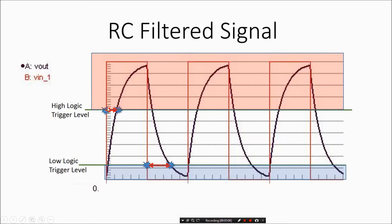The RC filter isn't good for D-shot because it shifts the logic zones to the right. When we get into the 26 microsecond range and things are very fast, instead of a clean square wave where the capacitor has time to fully charge and discharge, you end up with a sawtooth wave. You're neither charging nor discharging properly — you're in a noise realm where the signal might bump into the high zone, stay in the high zone, or never reach either logic level. So we need the RC filter removed.